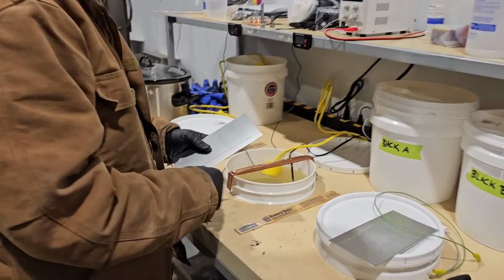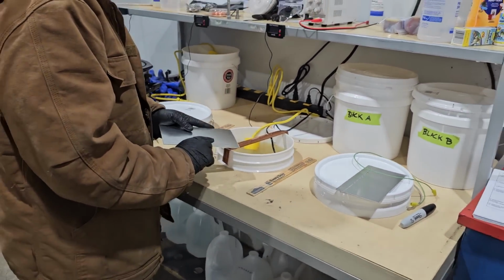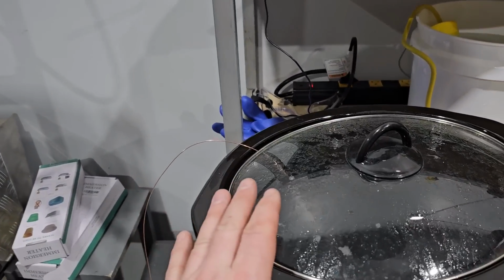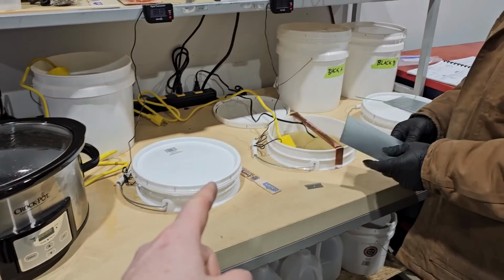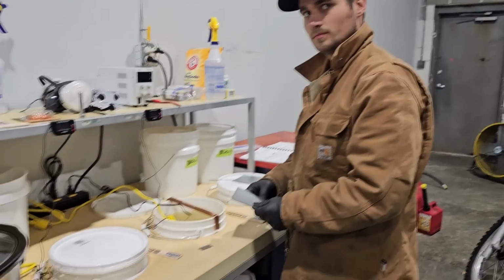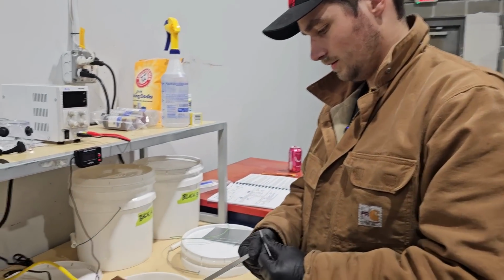All right, we are getting close. Seth is going to kind of fold these things up. We're gonna get them placed in the tank. We're just topping off the temperature for the tank there. We have our first test piece hanging in the degreaser, so we got just a couple minutes left of this. And then we will etch it, and then we will put it in here, and this time we're gonna plate it like 30 minutes to basically draw out all the potential contaminants from the liquid and stuff, right? Yes, that's the idea. Okay.